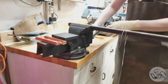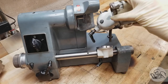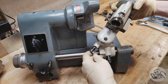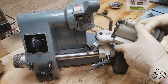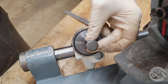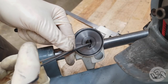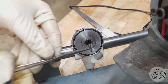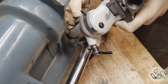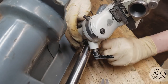Much like my previous employer did to me, I hung this out to dry and reassembly montage. Now it's finally time to refit the workhead, but I actually couldn't get it to seat down properly — it wouldn't go all the way in. So I took it apart and had a look. There's a main bolt that goes down through the center of the whole assembly, and this roll pin goes through the center. The trick is this roll pin has to fit in that little slot. I had to take it down and grind it off, and then the roll pin actually has to sit in there off center.